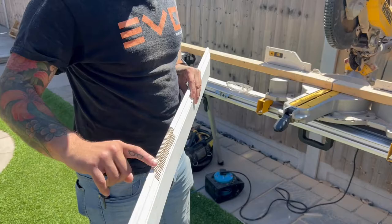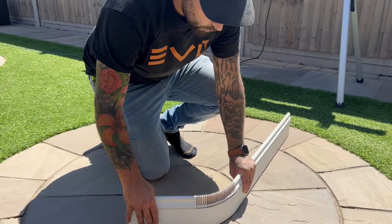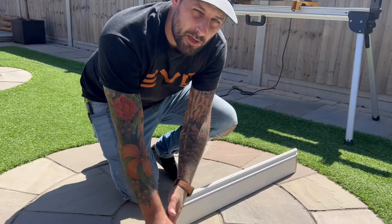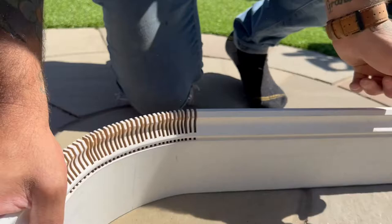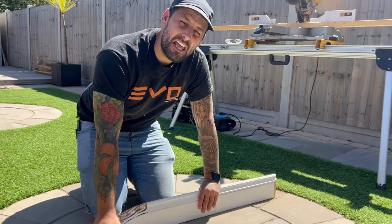If you've got a square skirting, which is quite popular at the minute, you won't really have this problem on the face — you'll only have it on the top. But come to the curve here and that's what we wanted: one sweeping bend, as you can see — a smooth bend. It does internal bends as well. Some people cut the face to get this, but with MDF you can sort of get away with it both ways. If that was your curve on the wall, as you can see it's a nice sweeping bend.